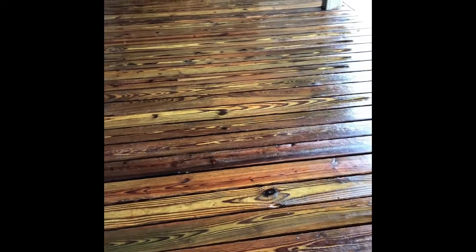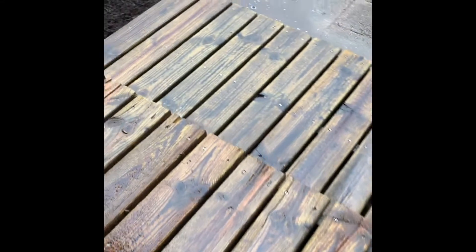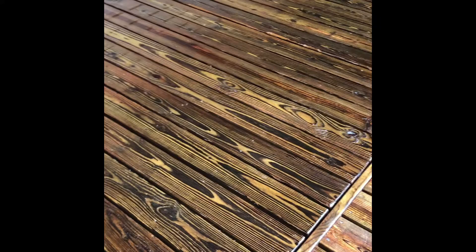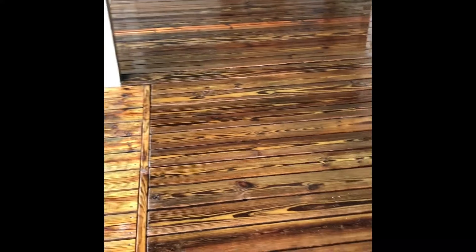About 500 square feet. Now you will notice out here this wood has gotten sun, whereas the wood underneath here has not. As far as I know it's all the same age wood, but it does show you that if an area gets sun and an area does not, it will age and weather at different rates. I think it came out really well, and the customer's going to be super pleased. We're going to go ahead and brighten with the oxalic.